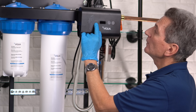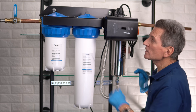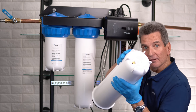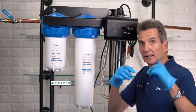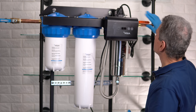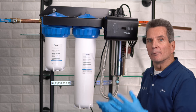Once the timer is reset, the light will start flashing green here and the controller light will go green. Wait until they finish flashing — usually about a minute to a minute and a half — until both are solid green. Then we can fill the system back up with water. Leave the outlet valve closed, open the inlet valve about halfway to fill up with water. Once it's filled, check for leaks — and make sure you've reinstalled that brass plug at the bottom of the filter housing with some clear plumber's silicone grease on the O-ring. Once there are no leaks, open the inlet valve all the way and then open the outlet valve all the way.